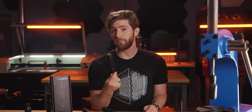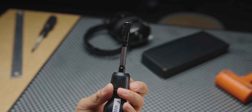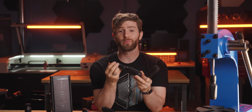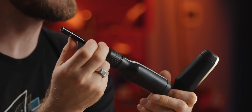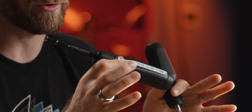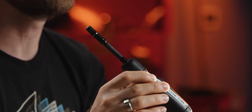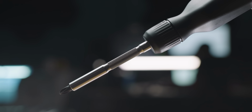One unfortunate thing that we learned during the testing of our prototype screwdrivers though, was that the black coating on the shaft was simply not durable enough. It wasn't for lack of trying. The 40 micrometer black chrome plating treatment was the closest we got, but even that got stripped pretty quickly, especially by sharp things like heatsink fins. So sadly, aside from some early orders where we are allowing people to buy the black one knowing that it's going to wear off, we're going to be primarily selling the screwdriver with a silver shaft so that it doesn't look terrible in a year.